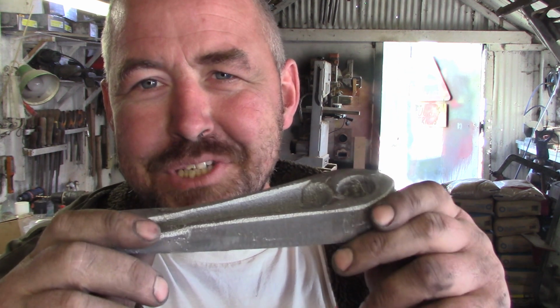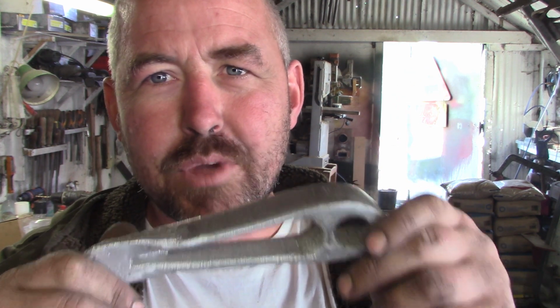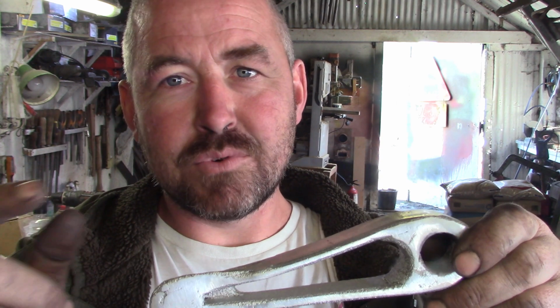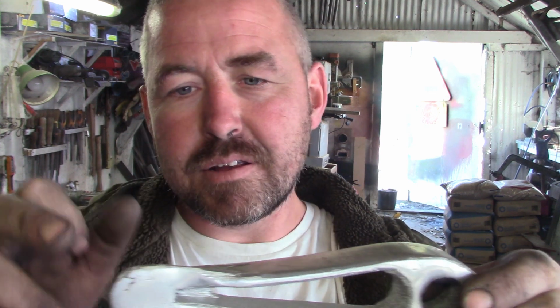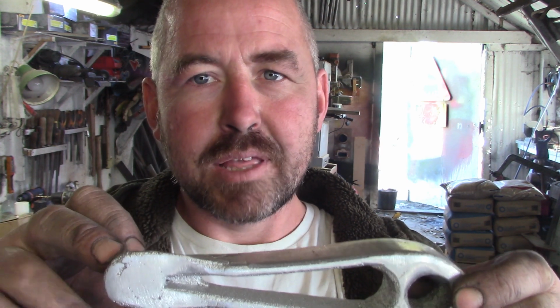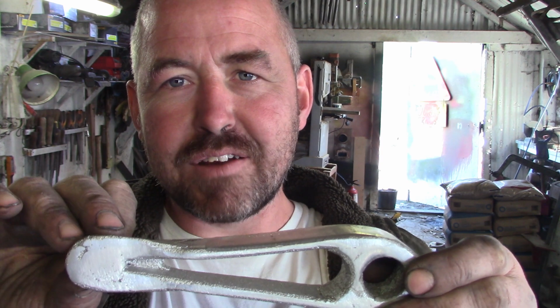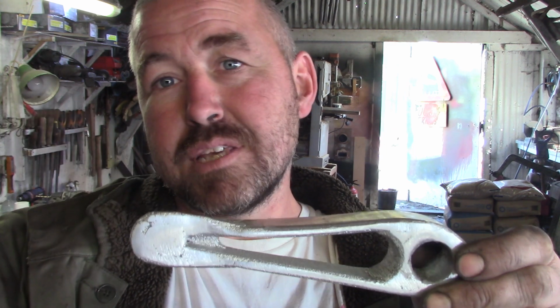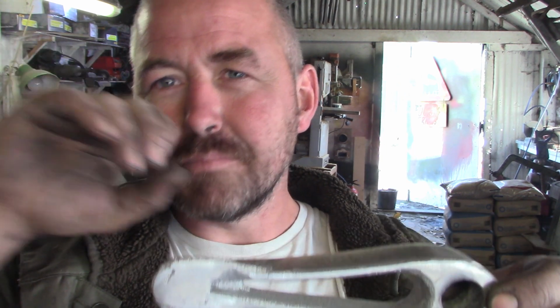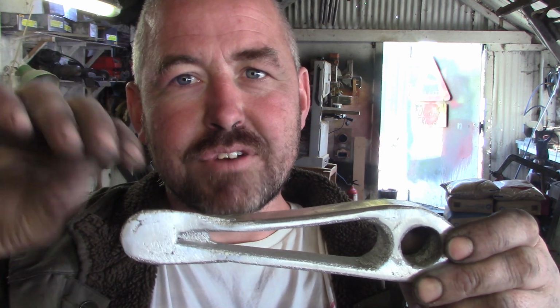Oh yeah, I was going to add, the cold seams, we can avoid them. We need to vent to avoid the cold seams. So the idea would be if we had the feed in this side and a vent over here, it would encourage all the metal to flow in that direction, and then they'd meet here and potentially make a cold seam, but then that cold seam would travel up the vent, I think. So we'd actually get a flow of clean, fresh metal that hadn't been burning stuff out, and the sand's already been heated up, travelling up the vent.